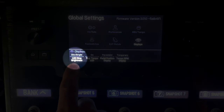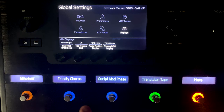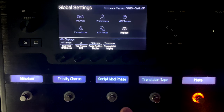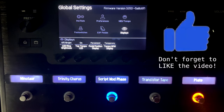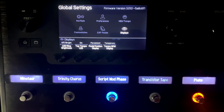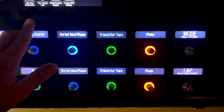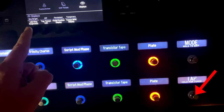Now to displays. The LED dim/bright setting gives you off or dim. When off, the LEDs are completely dark until pressed, then light up. When set to dim, they glow faintly when inactive and fully light when pressed. The fully-off option can be useful outdoors in bright conditions where it's hard to tell if a button is dim or just off. The tap tempo LED blinks continuously to show your current tempo - you can turn it off if it bothers you.